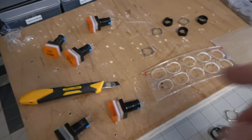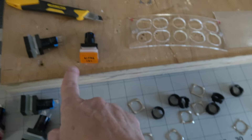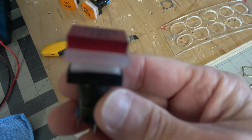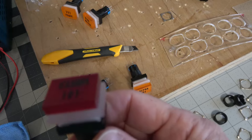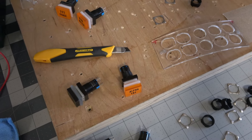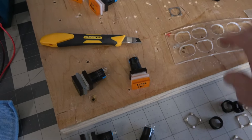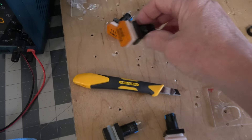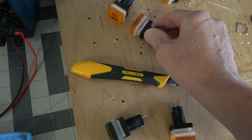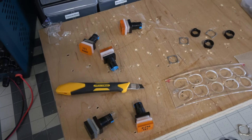The buttons on the ends of the panel — the orange or amber ones — you need to make sure that on one side the backing is flush. Unlike the other buttons where the opaque backing sticks out a bit beyond the button — which was originally made that way so buttons would stay in the panel for non-functional static display — because we're using functional buttons we have to be able to press them, and the middle standoff is going to be in the way. That's why these end ones you have to cut flush. I had to do it after the fact so I had to take the buttons apart and redo it — just something to keep in mind.